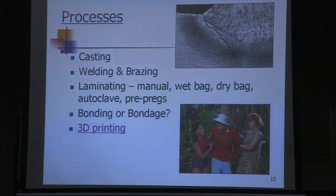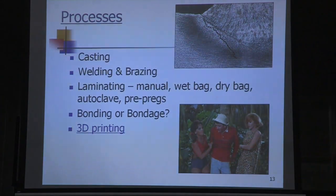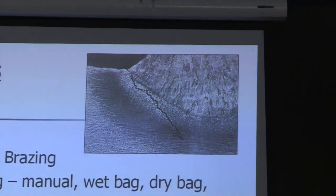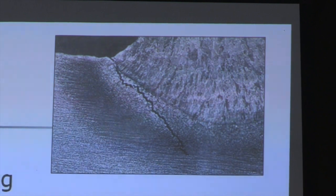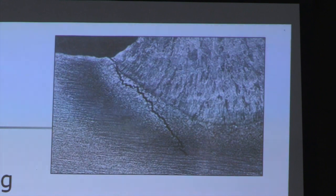Yes. Roughly, titanium is usually added to metals. It's called a seeder. So, when you have molten metal, you can imagine a molten metal chunk. And if we look at this image here, you can sort of see the grains. So what happens is if it starts crystallizing randomly, you'll get really long, weird grains, and as a weld shrinks, all the grains are long fiber things, and it has a lot of strain. If you add titanium or scandium or a couple of other things to it, they seed the weld. So instead of randomly crystallizing, it'll crystallize in a whole bunch of spots. That starts as a seed and makes nice spherical grains. And so the shrinkage is controlled a lot better.